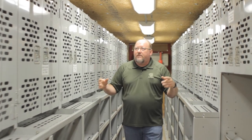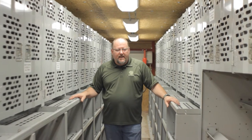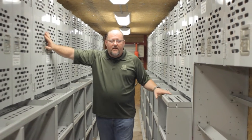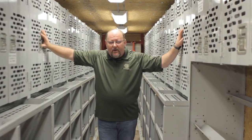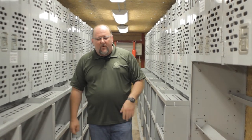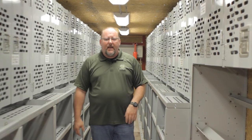This tool crib is actually an 8 psi, 200 millisecond medium response booth. All the reinforcements inside the walls, combined with the metal tool crib cabinetry on the inside, reinforce the wall so it doesn't bend in or move. We also have reinforcements along the floor to help keep cabinetry from moving in a blast.